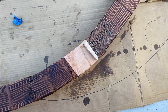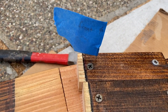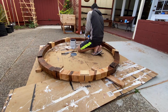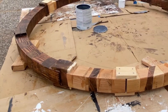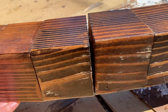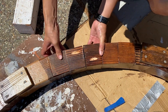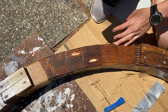Before putting on the finish I realized I should label which side was up, down, front, and back — especially since I would be flipping it around so many times. I propped up the whole circle on 2x4 scraps to allow the bottom to dry better. As I was rolling the circle back and forth multiple times, I think it made some of the parts vulnerable, so I had to repair it using screws and covered the holes with wood glue and sawdust.